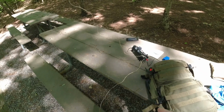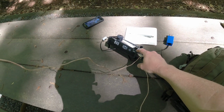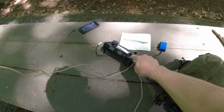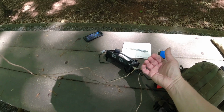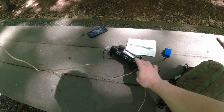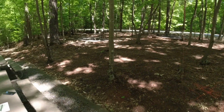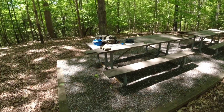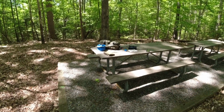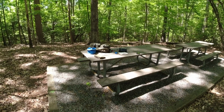Now, of course, this isn't resonant, so what we do is put it in this BNC binding post and connect it directly to my radio, which has a built-in antenna tuner, which doesn't actually tune the antenna. What it does is find an impedance match to make the transceiver happy. So this isn't the most efficient of antennas, for sure, but it works. It works really well for Parks on the Air, for Summits on the Air, and things like that, where you are the DX. People are listening for you, so you don't have to have a huge signal.